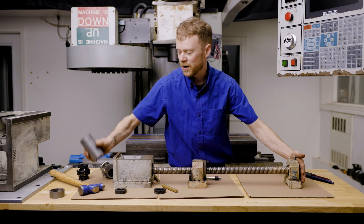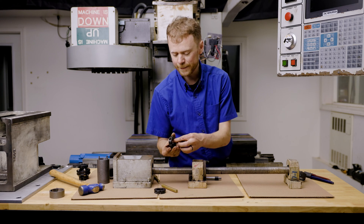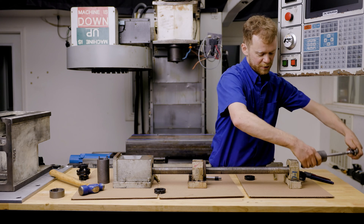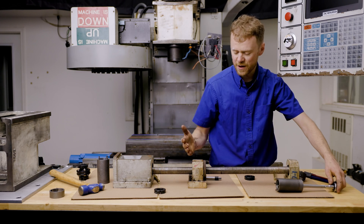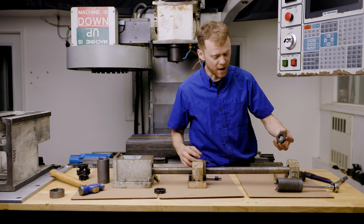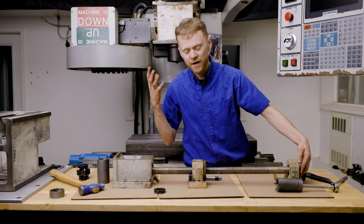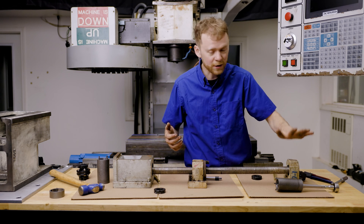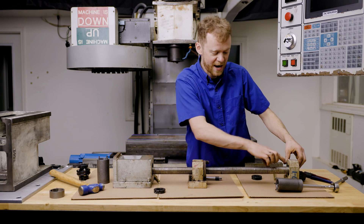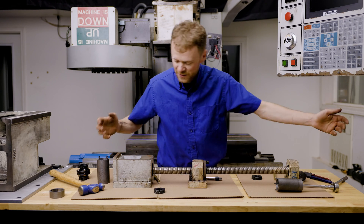So if you have the tools, you put that in there and pop this off — then you're good to go. Come over to this end. Unscrew the clamp screw, and this one you could just hit with a punch or hit it and quick pop loose. The weight of the table is going to be on this yoke; the yoke would be flipped up and it would pop off. This shouldn't be tight — if it's too tight, you're stretching the screw. There are no angular contacts on this end, so you're literally just squeezing the outer race in and tightening everything up on the radial bearing. Don't over-tighten this. So this nut's off.